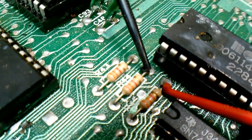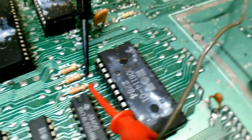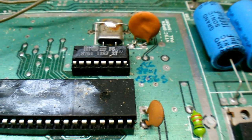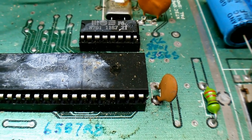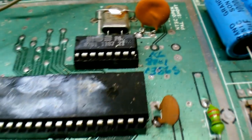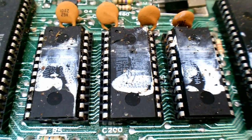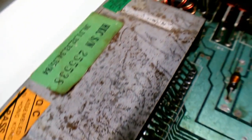I'm going to pull those clips off because they serve no purpose. The camera might not be picking up all the grungy details — there's schmutz on the PLA chip and a greasy coating all over the board and chips. There are also handwritten notes on the PCB, probably from somebody pulling chips and replacing them, leaving a trail as to where everything goes back. Overall, everything's really dirty, so it's a good candidate for plucking those socketed chips off. This board has definitely seen much better days.